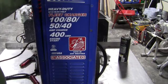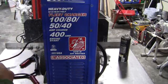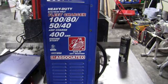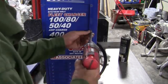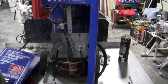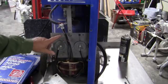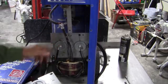This is an Associated 6002B battery charger. It's a heavier duty unit — this will charge up to 24 volts. It has the same condition; it's not putting any output out. I took the side off this, and in this unit you can also take the front off. The front comes off, and as you can see, that uses the 610100 rectifier plate. It operates the same way as the other one we showed you — it's just a larger unit and it has more diodes in it to take a heavier load. I did test this before, and there is no output from this DC also.